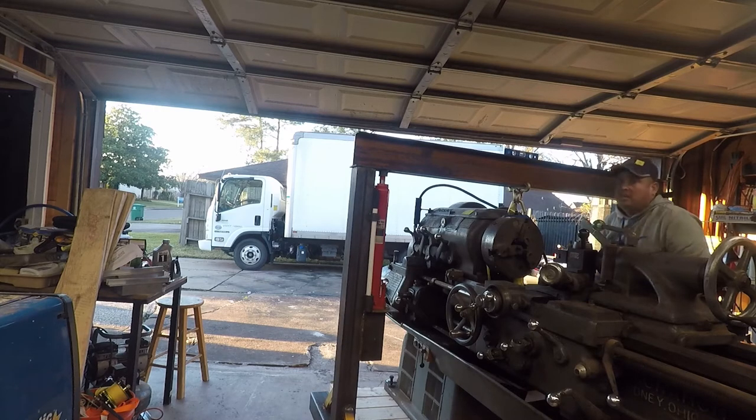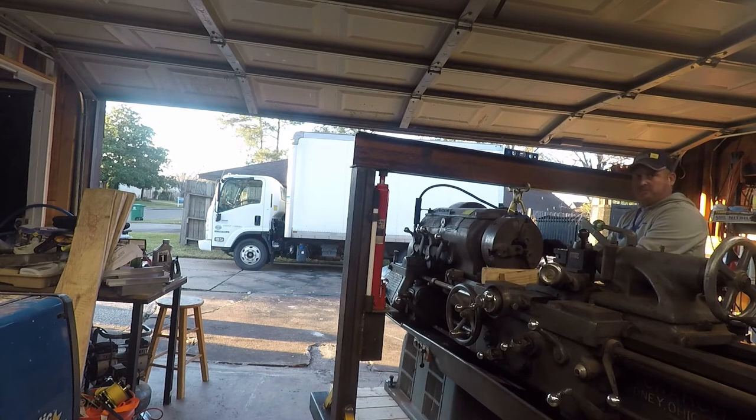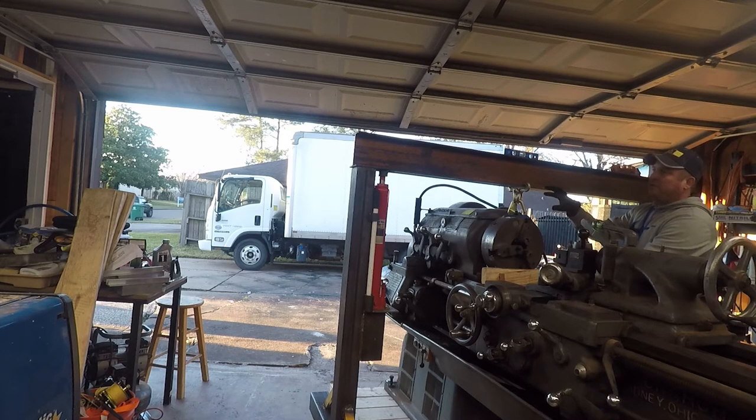Okay, so all it takes is a pair of 2x4s underneath the ways in the right spot to lift this machine. Now, before the comment Nazis get excited, the beam is rated for a little over 9,000 pounds and the strap is rated for a little over 6,400 pounds. The D-ring and pair of hooks is rated for 10,000 pounds. So I'm working with really sturdy safety margins.